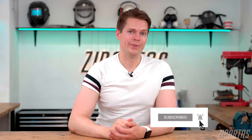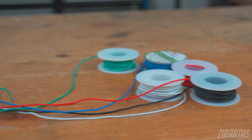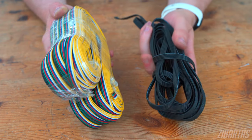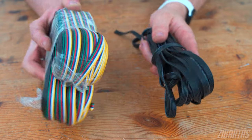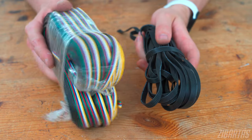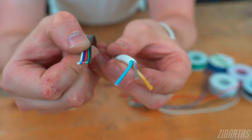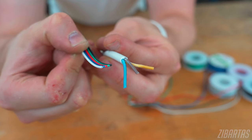The best cable management is the one you can avoid altogether. Instead of buying and using individual wires, you could be buying multi-strand ones, or even better, ribbon cables. Ribbon cable is a kind of flat cable which has strands already wire-managed and grouped for you. They're kind of like regular multi-strand cables, but they don't have an additional layer of insulation around them, making them that much thinner. I just really love them for DIY projects — they reduce bulkiness so much.